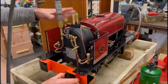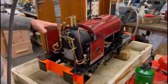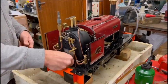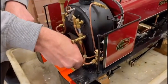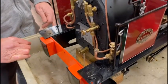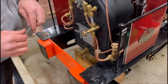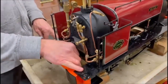The surefire way of really making sure is to let the loco run for a little bit on air, switch it off, remove your air pressure, and then open the blow down. We want something like about 15 to 20 seconds worth of water to come out — that shows that the pump's working properly. I think that pump's working pretty good. I'll be quite happy with that.